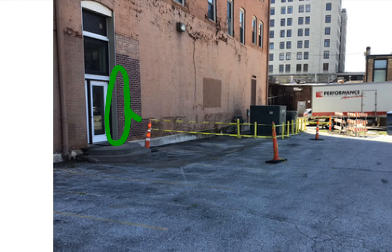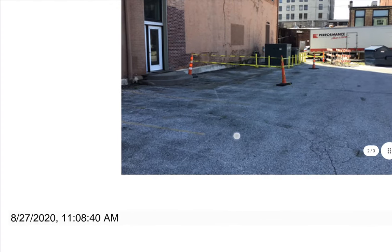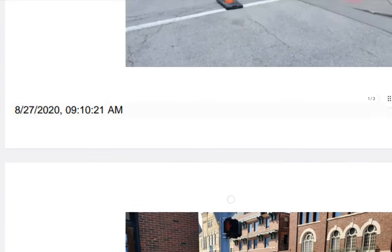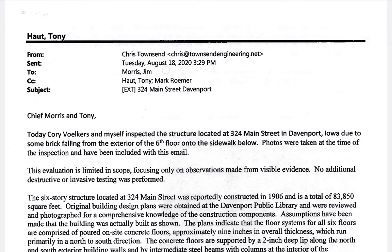This is the one where I talk about the guy's brickwork — it looks nice, lines are clean — but remember there's no tying from one side to the other, no wall ties used. What's also noteworthy is this area — it's not buckled away yet, but we'll get to an image showing it buckled away. What's now clearly identifiable are all these spots showing face buckling. At 8/27/20, this section was still connected to the structure — that's when they had that facade issue they worked on.